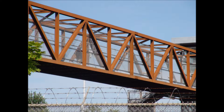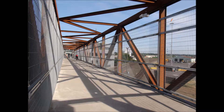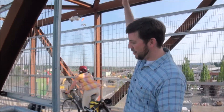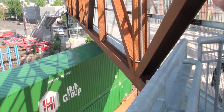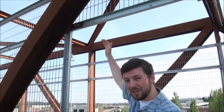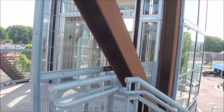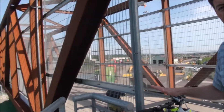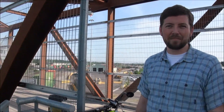The engineers at KPFF designed this pedestrian bridge in southeast Portland. Chris Pitt was the engineer in charge of the project. The original design used eight-foot-deep concrete beams — like you'd see for a big highway bridge — which would have been pretty ugly and raised the walking level way up. Since you can't go any lower because of the train clearance, you'd need taller elevators, taller stairs, and everything gets bigger and more expensive. So we came up with the idea: if you use a through truss, now all of a sudden you're walking really close to the bottom, and you just don't need so much of that extra expensive stuff.